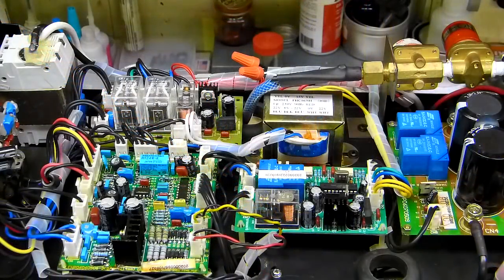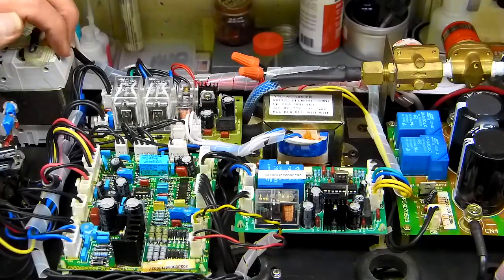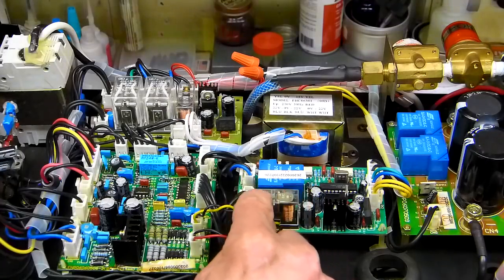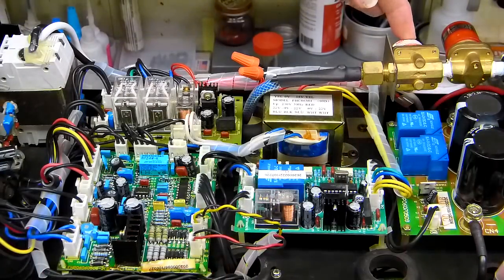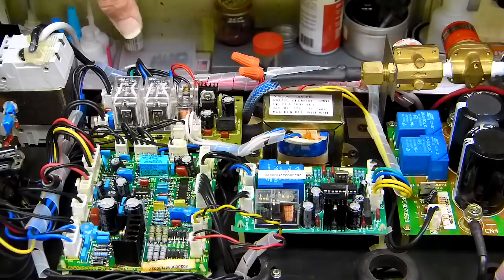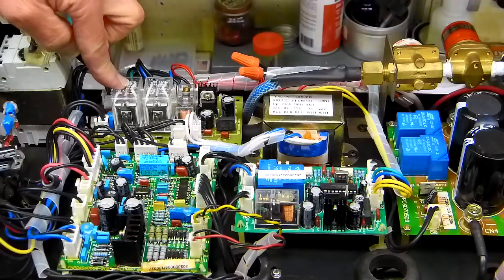Looking down at the top of the machine, here's your power switch. When you pull the trigger and start a cut, you'll see these two relays energize, and this one as well. This relay is what turns that air solenoid on and off — you can pull the trigger, let off, and exactly at the 20-second interval when the air shuts off you'll see it cycle. This relay here is actually controlled by that reed switch in the current sensing coil.